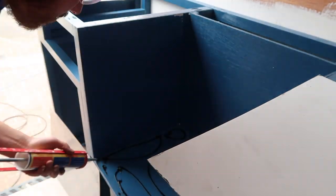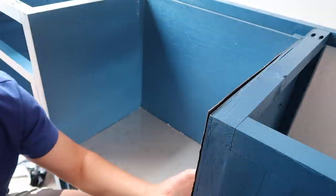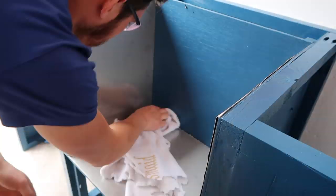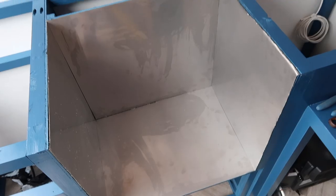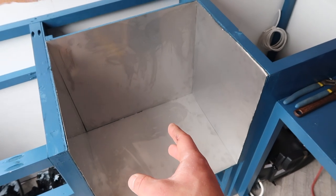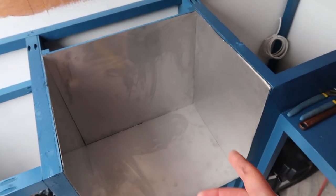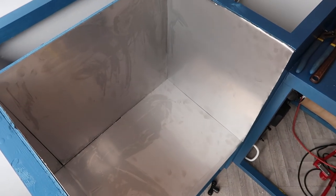A note in hindsight on the bottom sheet - the side panels I cut to size and used a hammer to bend where the cut wasn't exactly perfect over the top. What I would have done is just not cut them down and bent the metal over the top in the first place so the bench would cover it. These four sheets in total cost £45. If you wanted them cut to size you'd probably be looking at £100, so you pay double - but the trade-off is cutting them yourself.